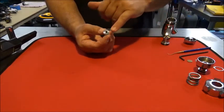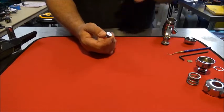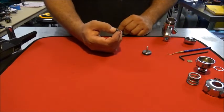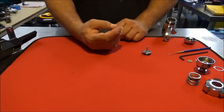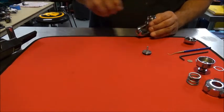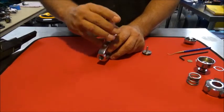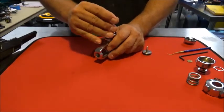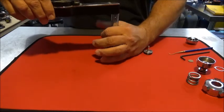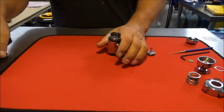I went ahead and saved camera time by replacing the O-ring and the backup washer in here. It's important to get those right because that's what is sealing - or part of the seal of - the high-pressure air around the stem of the piston, so take your time. This is one of the few times that U.S. Divers actually specifies a torque spec - it says this is supposed to be torqued to 40 inch-pounds. We'll get this threaded in, use our torque wrench, zero it out, and torque it to 40 inch-pounds.